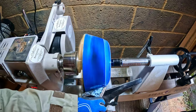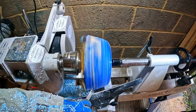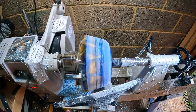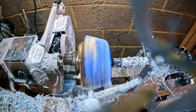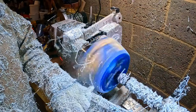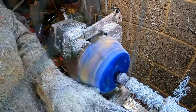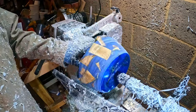All nice and secure, I could begin turning. First I tried a freshly sharpened bowl gouge but this just shattered the surface, so I quickly swapped to the Easy Wood Tools full-size finisher. For this casting I used a different mould which more or less gave me the shape I was looking for. So all I had to do was get the piece to round and expose the timber offcuts. Using the carbide cutter I was soon through the chipping left by the gouge and down far enough to see the timber offcuts. I changed the camera position as it kept getting covered in ribbons of resin, but with this project the resin just seemed magnetised to the lens.